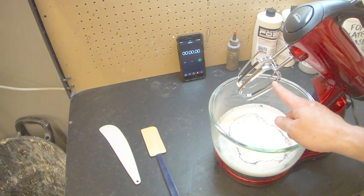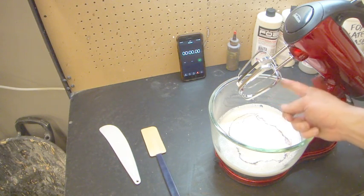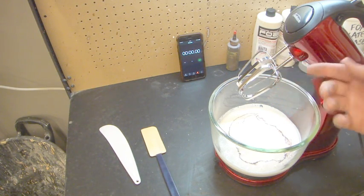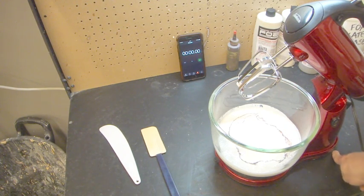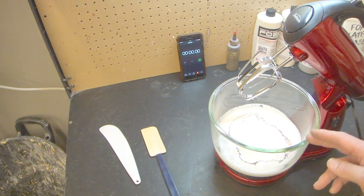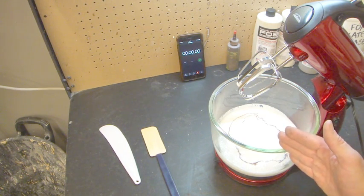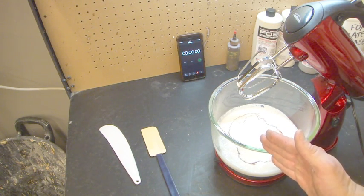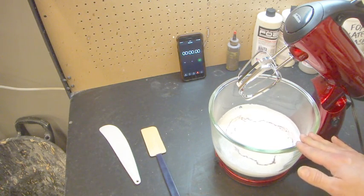I don't like taking it any higher on the beaters than about here, right before it starts curving up and in. You certainly don't want to have it going over the top of the beaters, because then when you add your gelling agent, it's possible that it's not going to reach some parts and it becomes unmanageable with trying to get rid of the bubbles. So that's your whipping phase. Then we have our mid-range refining, and then we have our ultra refining, and then we add our gelling. So that's part of the refining process.